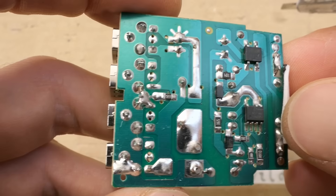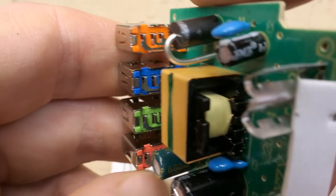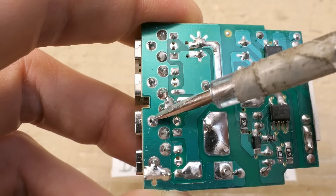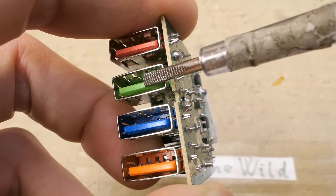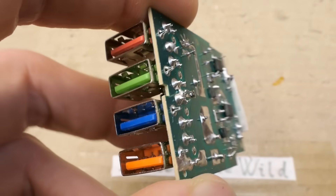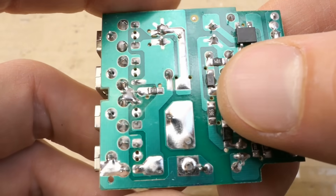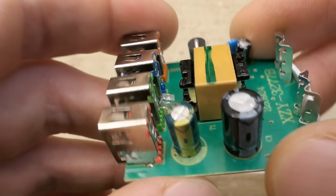There is also no chip on the secondary side to communicate with the device. So obviously this could never switch its voltages — it's just 5 volts. It was never meant to supply any other voltage. The data pins are probably just connected with each other on these ports, and of course all four ports are connected in parallel on one negative rail and one positive rail. When the maximum for one port is 1.8 amps, it also means the total current for all ports is 1.8 amps maximum. There's a loading resistor here — more likely it's the resistor for the LED.